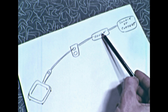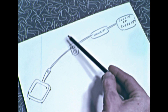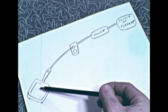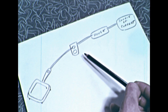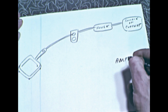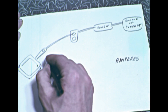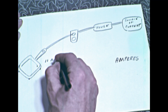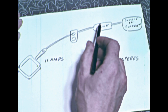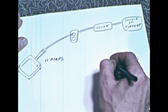The circuit is made up of one wire that leads from a generator — the source of current — to the house, to the pan, and a second wire that leads back in a continuous pathway to the source. The amount of current that flows in the house circuit is measured in amperes, sometimes called amps. The frying pan carries about 11 amperes of current. This is alright because the wires in this circuit, as in most house circuits, will safely carry 15 amperes of current.